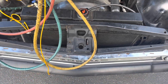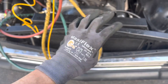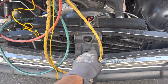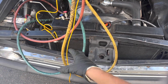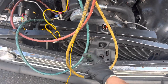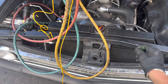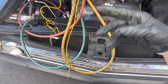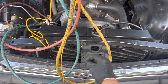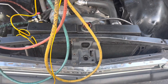Buy the cheapest price and that's what happens. If I was going to sell and install this, I would just go out and try to find a condenser manufactured by Denso — cross-reference a van, an SUV, or something like that with dual AC — something that would fit in here, make up my own custom fittings and brackets and make it fit, because these are just cheap universal condensers.